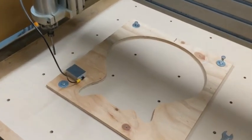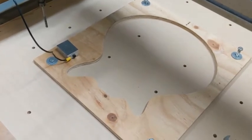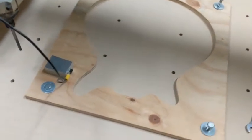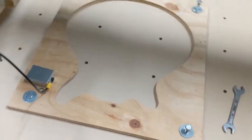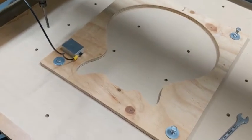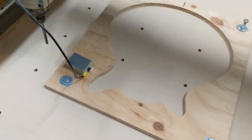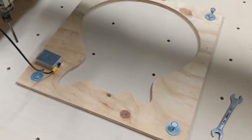I've made some alterations to my Mach 3 program this evening. I'm going to do some milling using a jig, and I need to know exactly where the jig is on the table each and every time. The problem is my homing switches aren't as accurate as I'd like — I couldn't get a decent repeatable cut; it was a millimetre or half a millimetre out, and it was fairly obvious on the finished job.